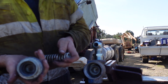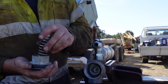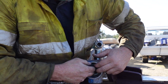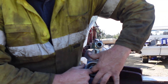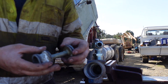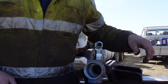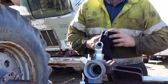If you look at that end cap, you've got a sealing surface in there — a thick section rubber washer — and the spring fits down through the guts of that. Then in here you've got your spool. He's been sitting around a while; there's been a bit of water in it. You can see some of the scale, but there's still a little bit of lubrication on those O-rings.